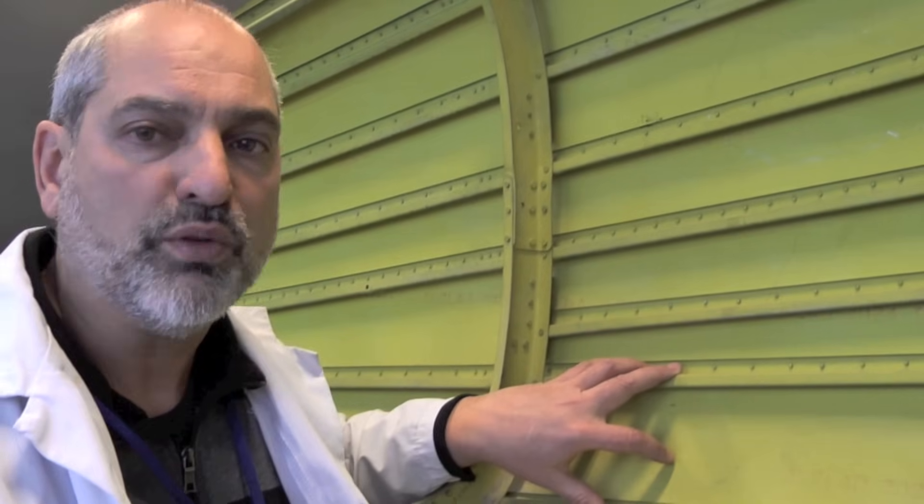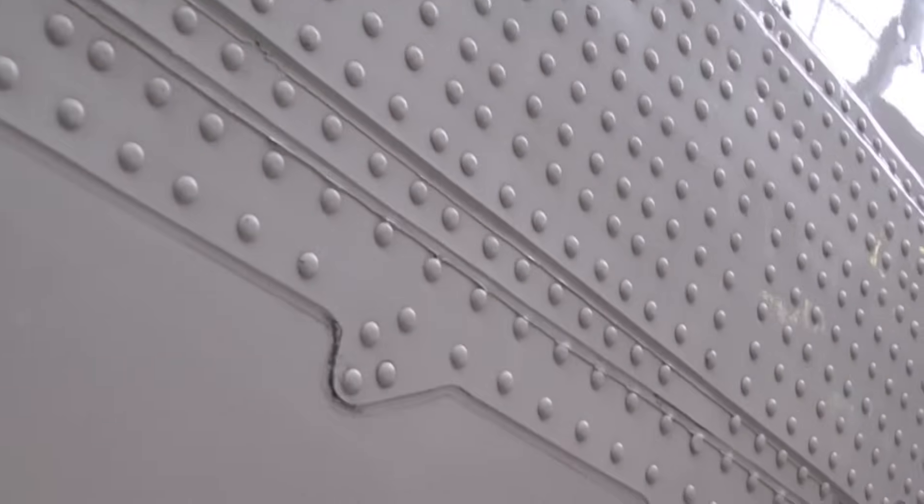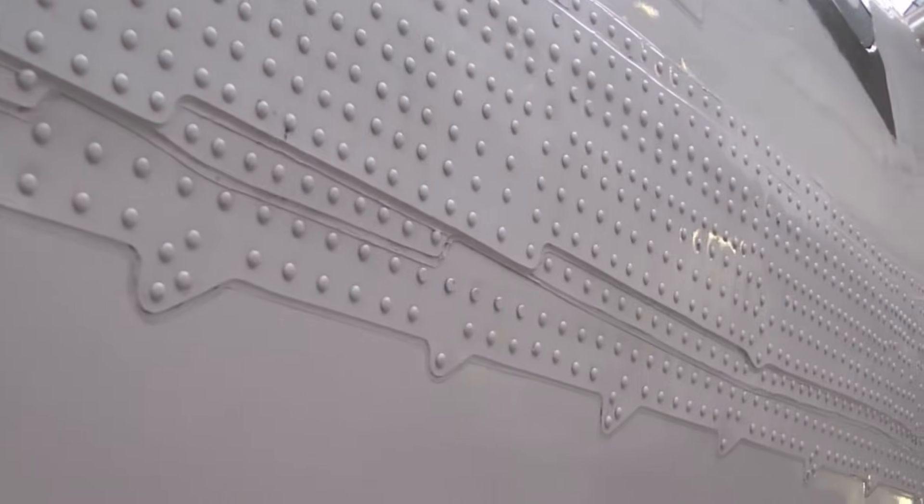Hello and welcome to M Level 3's podcast on installing solid aviation rivets. Aircraft bodies are riveted together rather than welded because each rivet is removable without altering the temper of the metal skin. Thousands of rivets will form joints that are stronger than welds without the related cracking.